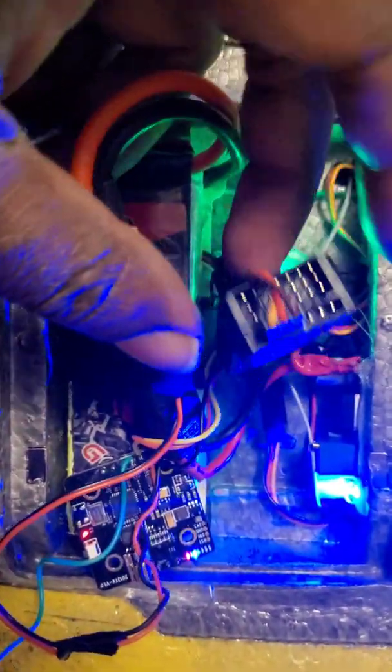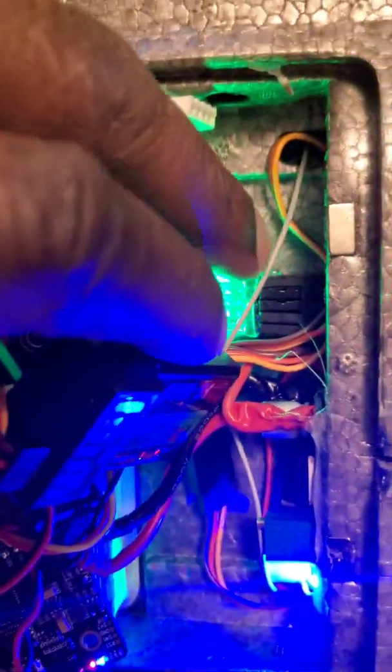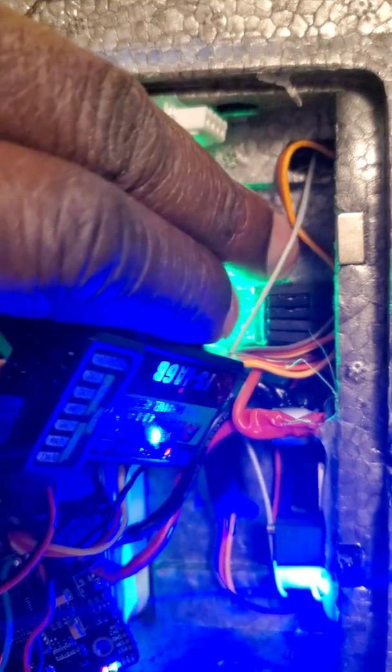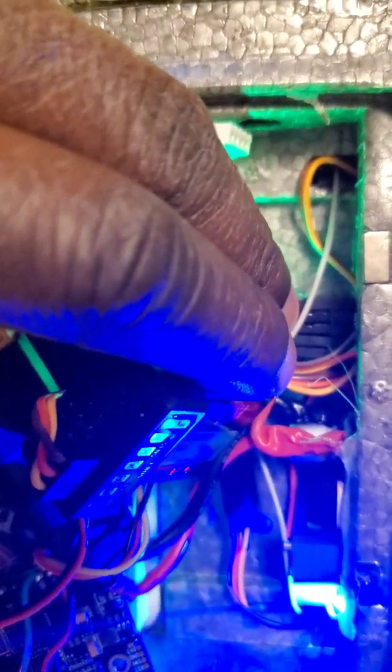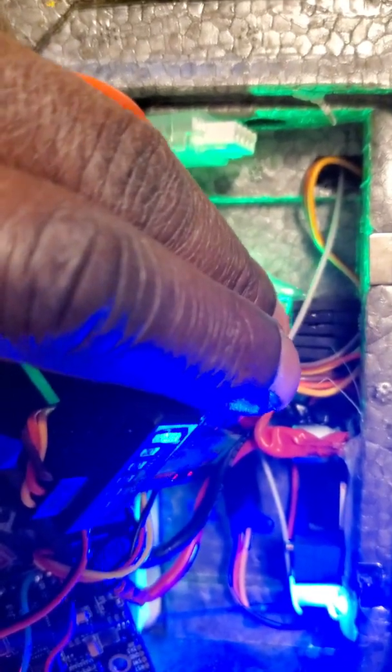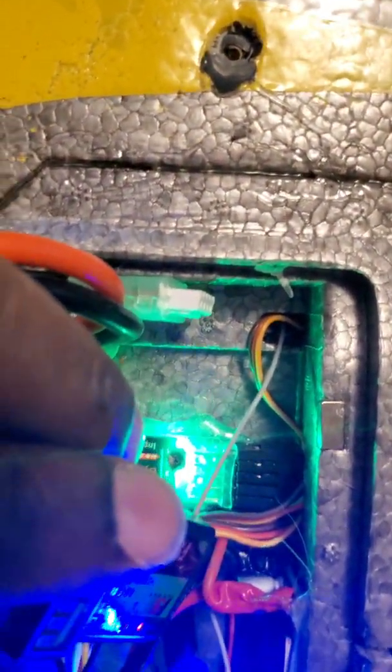With the gyro, you've got this one for your left aileron rod, this one for your right aileron rod, and one for your throttle. I have power coming off the BEC — that's the blue light, the adjustable BEC — it's got two capacitors on it. That powers the gyro, and then the gyro powers the receiver. That's it!